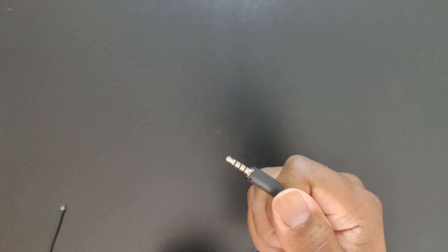Once it's tight, you have your other set of banana plugs — now you're ready to go. The only other thing I have to say about speaker wire is make sure you're paying attention to your equipment. Some equipment has a spot for these banana plugs, some do not. This particular speaker here — you see how it just has the pushdowns? This kind of speaker will only work with the bare metal connections. These banana plugs will not fit in there. So take a look at your equipment and make sure you're buying the appropriate hardware and accessories.